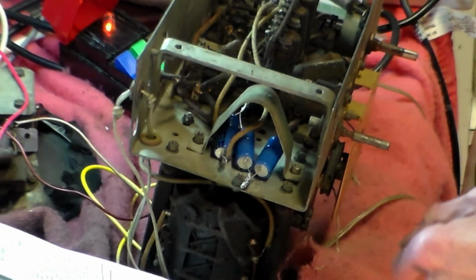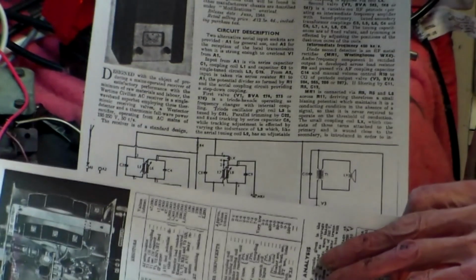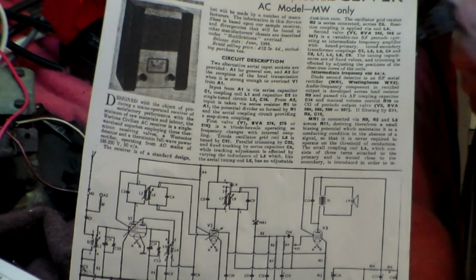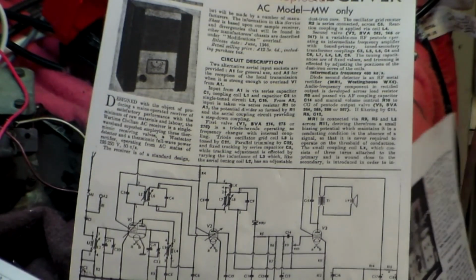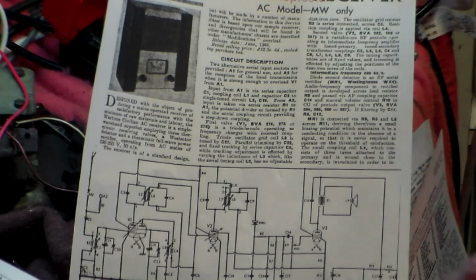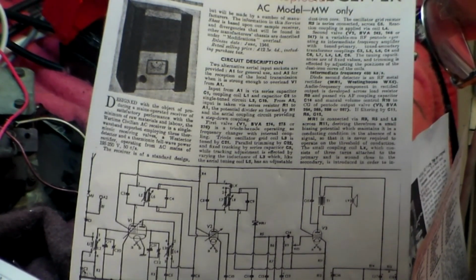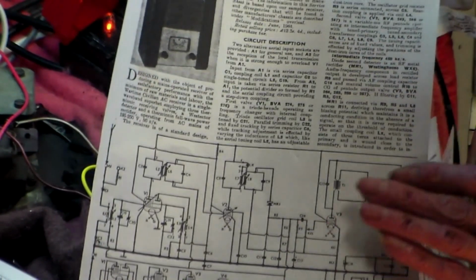Now the fact is, pin 2 of that goes straight to the AGC line here. And so if it is pin 2, which I can look on here, I think. Okay, maybe on this one here. This is where manuals do come in and do rather a lot, you know. We need to find out, it's L6 and L5. So L5 pin 2 goes to that line there, and pin 1 goes to the grid of valve 2.